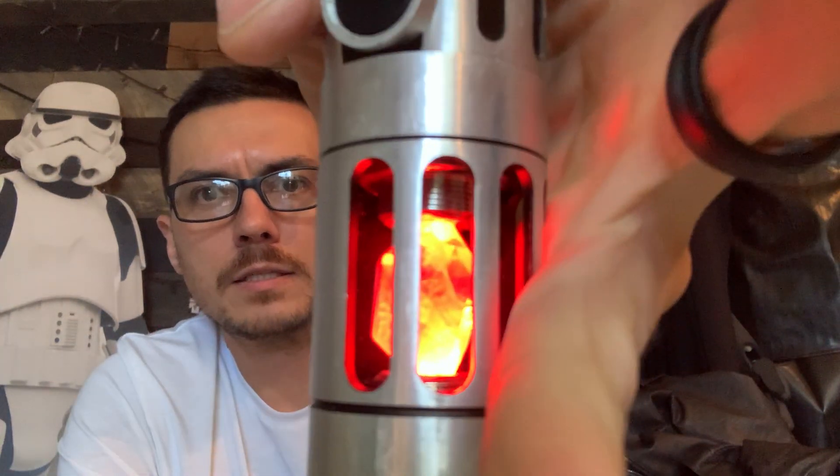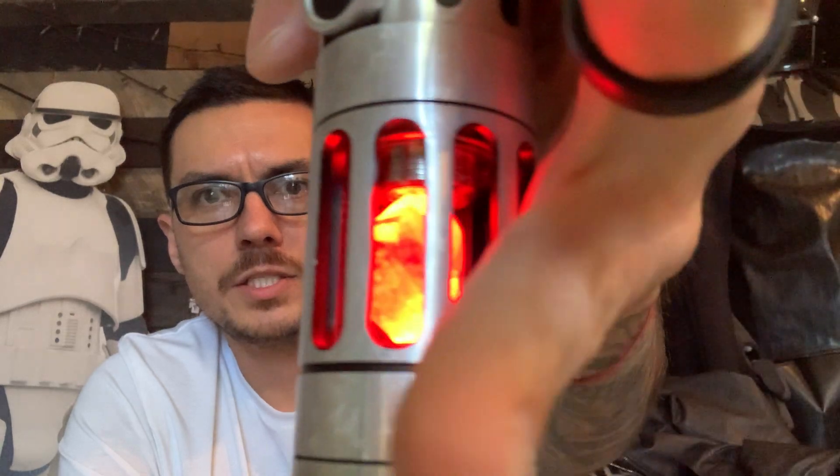Hold it to turn it off. The way I wired this up was similar to what you had before, but previously you had three neopixels on a strip kind of bent and floating in there. I took those out — a crystal chamber only needs one neopixel if it's wired correctly. I put that one pixel right up underneath this crystal with a little bit of superglue, and that one pixel is just lighting up that crystal beautifully. That's a great shine on your crystal.